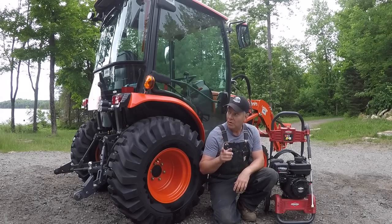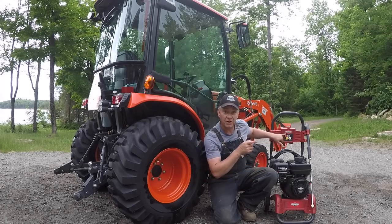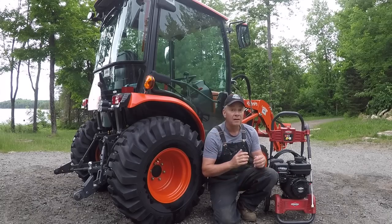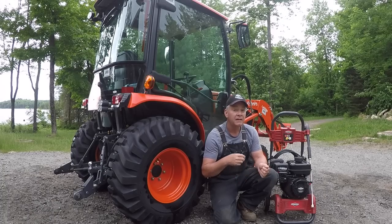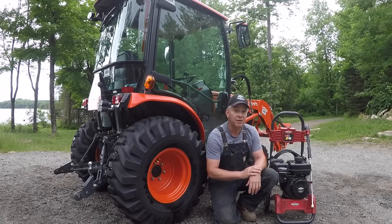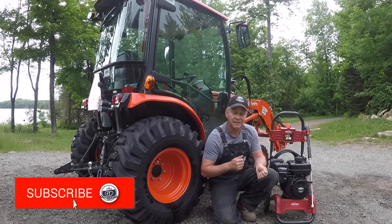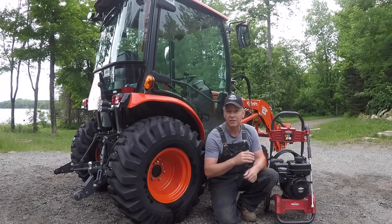Performance. Worked really well. Being on this well pump, I did notice that when I was using the red tip on the trailer frame, the first couple of times I could hear the pump turn on at the well. Pressure dropped on the wand. I let go of it, gave it a minute, did it again, took a second, but for the rest of the afternoon, when I was pressure washing the frame, didn't lose pressure at all, even though the pump was cycling. But as one of my subscribers told me, he's got the same thing where he lives, as soon as you start to see it lose pressure, just release the wand, wait about 15, 20 seconds and push it, and you get your pressure back.